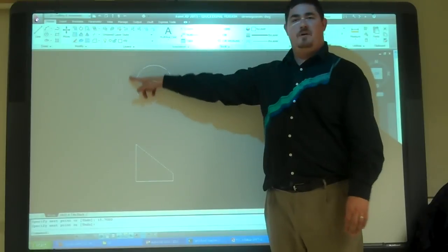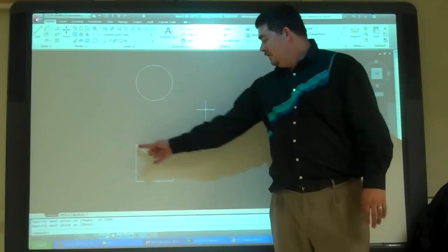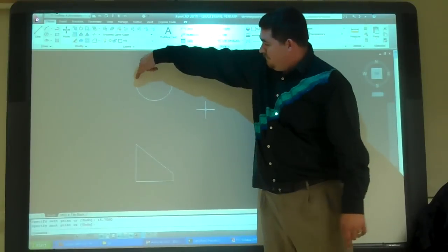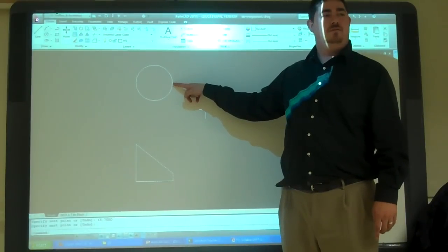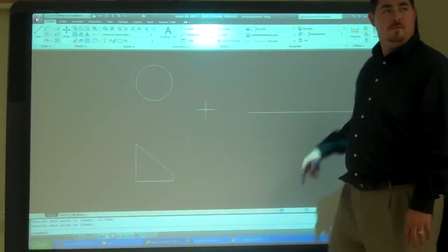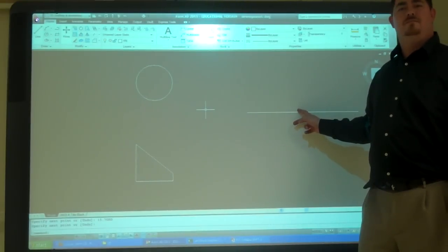So where am I going to make my break point? Maybe right here on this quadrant, where it's the short side. Because this line right here, and that one there, those are true length lines, right? But this is the true length line of that point, the quadrant. And this is the true length line of that quadrant. Correct? Yes. So if I copy this one to the two ends, and this one to the middle, I'm on the way, right? I know those points are right. Agree? Okay.